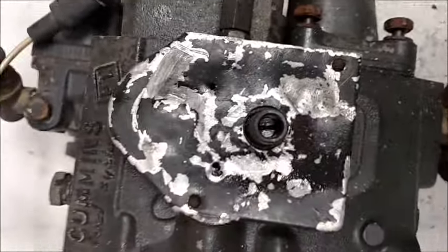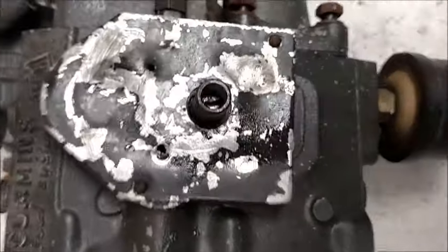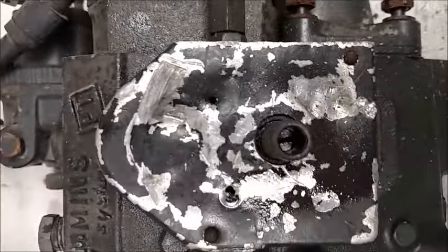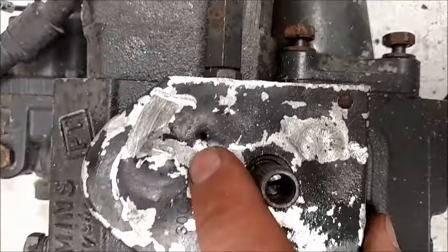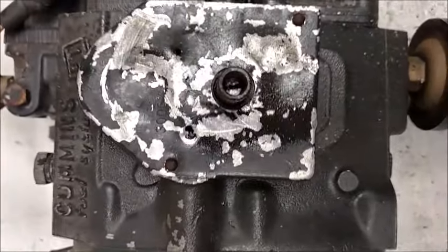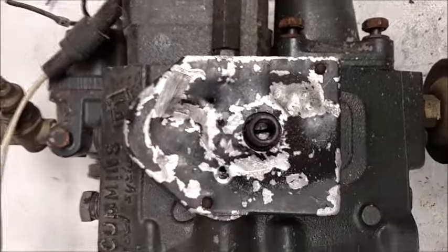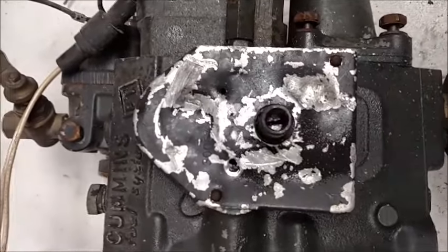Alright, so this segment we're gonna call lessons learned. I was told just drill a small hole through there, hook that ball with your pick, pull it out. Well, I had several drill bits break — evidenced by where it broke and I poked through here, and broke again and poked through here. Lessons learned: do this in a drill press, do it with brand new drill bits. I went through a lot of drill oil and five or six small drill bits.